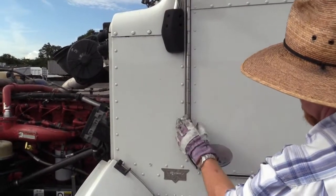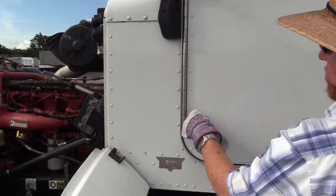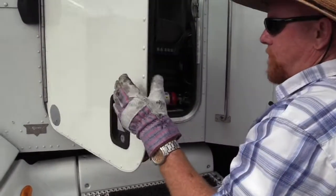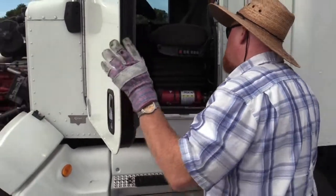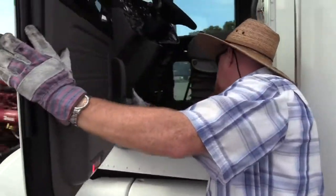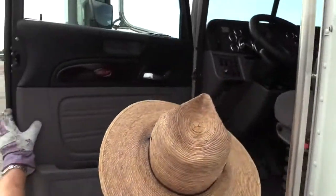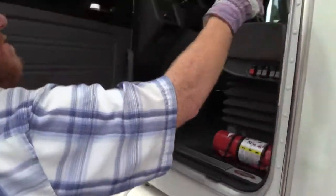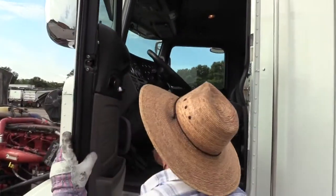They look in good shape, secured, not damaged. None of the paint's cracking, or if they've been moving or something. I need to know that this door opens properly. It does. I'll check the inner hinges. They're all secured, no damage that I can see. My weather stripping, need to make sure it's all present, secure, intact, no damage.